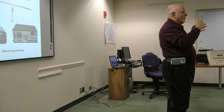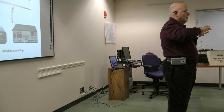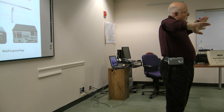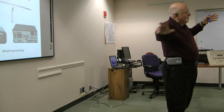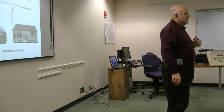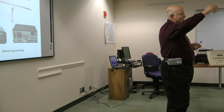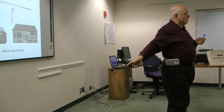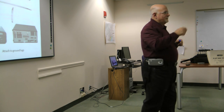That's why, for example, twin lead is especially subject to that. So when you have twin lead, you always want it coming perpendicular out from the antenna and going a considerable distance away before you turn it so it runs parallel to the antenna. In fact, you're better off putting a balun out there, bringing the twin lead to the balun, and then having coax that you run along the ground or bury, if you have to have your coax running parallel to the antenna.